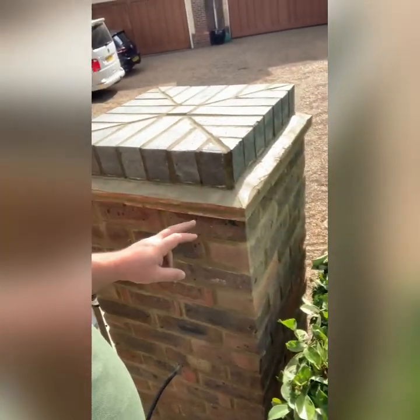And I'm just putting that in with a little bit of feather edge, so putting it on, just compacting it all in, and then running the jointer over it, and then just brushing it off. And yeah, I've had a little go with the old dish sponge with the green like wiry mesh type thing. Just run that round on the tile creasing, just to clean up any bit of mortar that was on there from yesterday. But yeah, that's where we're at.